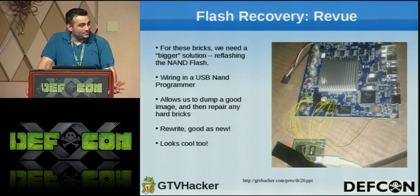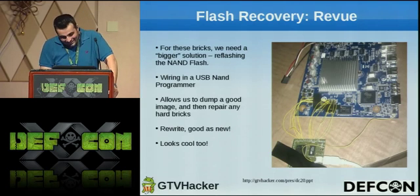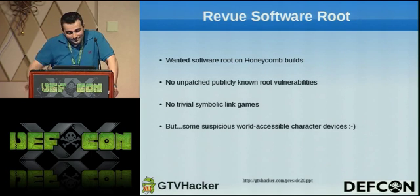We have some alternate points if anyone wants to give it a shot that we can pass out, but this was an early picture. It allowed us to essentially test all the stuff we wanted to, verify the bootloader was actually signed, flash a modified one to see if we could get it to boot. And just give anything a shot that we really wanted to without a risk of having to go buy another expensive, crappy device. But yeah, so we had to add that picture.